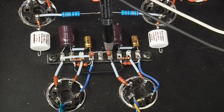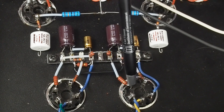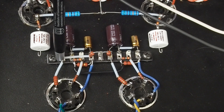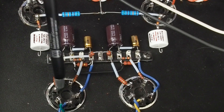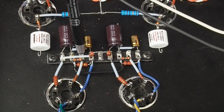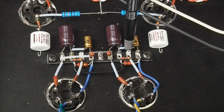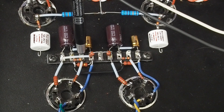So this then becomes the plate voltage. This is our plate load resistor and it goes to the plate of the driver tube. Same thing down here on this end — this is the plate voltage, which we're hoping will be around 35 volts, then we have this 22k plate load resistor going to the plate of the tube. I decided to make this tag and this tag the input for the driver tube and the amplifier, right next to the ground, so when we use the shielded cable it'll be easy to connect the signal and ground.